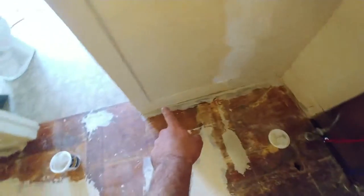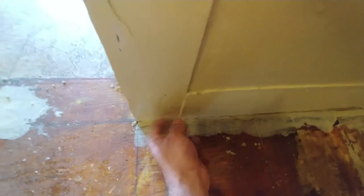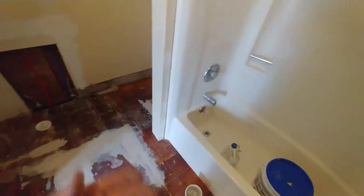I can't just rip it all off and add three-quarter inch trim all the way around the room for a really nice look, because I'd crash into the door trim and be out however much, which would be unacceptable. I thought about adding to the face of the door to get it out far enough for real trim, but then I found they had trimmed the tub insert too and it dies into there — you just keep compounding the complexity.